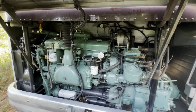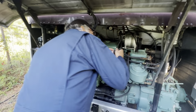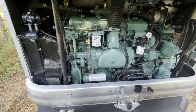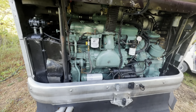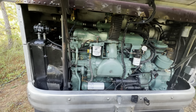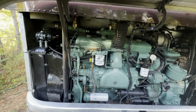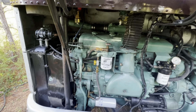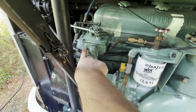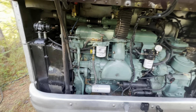Now that we've got it up the top of the hill we're going to do one more oil change and get it ready for a test drive. If you remember, it came in with the valve bridge guide broken and pulled out of the head. He was getting coolant in the oil and got towed in. The valve bridge guide broke as it pulled out of the head, and where it goes into the head that actually goes into the water jacket. So we had a ton of coolant getting into the crankcase. When it came in we drained 15 gallons of oil and coolant out of the crankcase, and that only holds like five, five and a half gallons normally. So it was definitely way over full — the crankshaft was definitely hitting the oil in there. That's how bad it was.